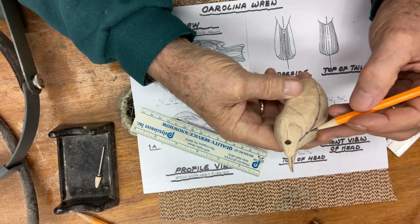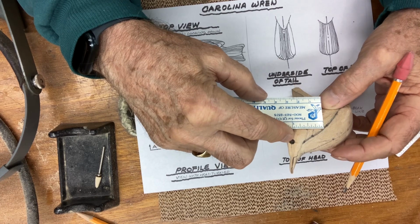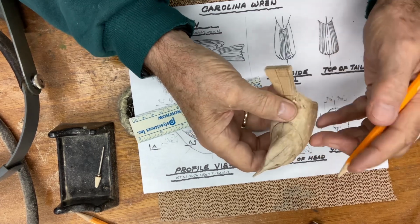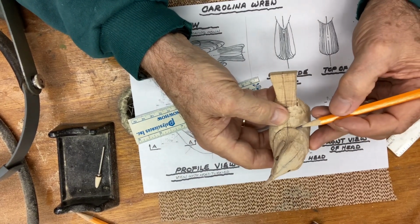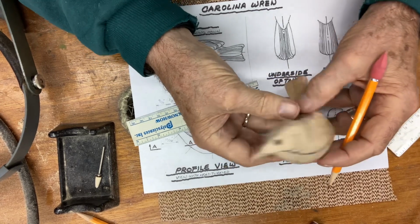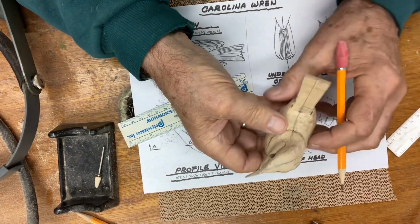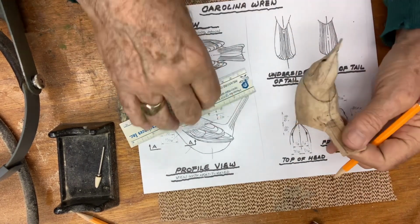And we're going to do the same thing on this side, except that it's not 3/8 on this side. On this side, you're just off the cheek about 3/16 when you're passing the cheek right here. So you're aiming this way, and then you want to get a nice flow similar to what we have here. We're trying to make it symmetrical, but it's not 100% symmetrical. And we're arcing this around like that. Now you can come around here, and you can come around to there. And that's what we're trying to do: put the boundary for the mantle. This isn't gospel, but it's close.